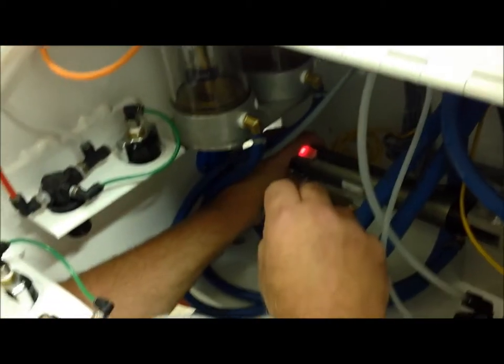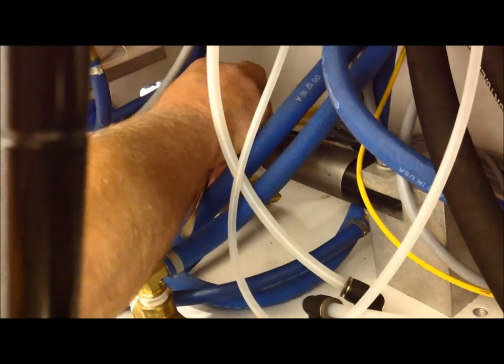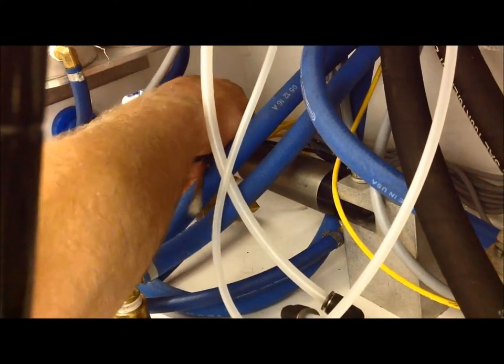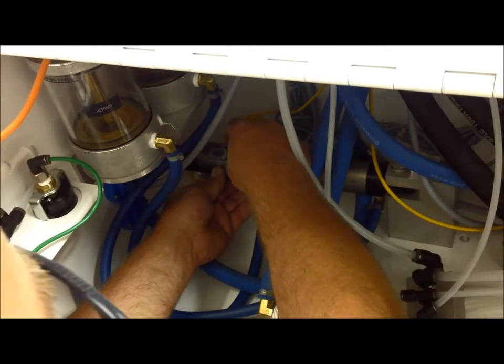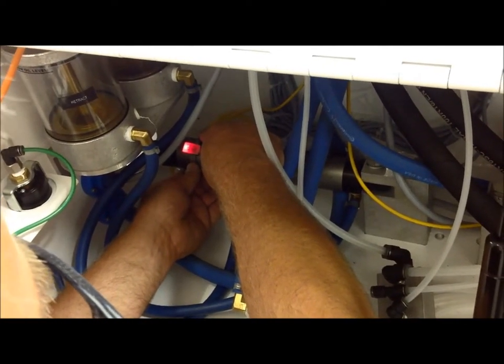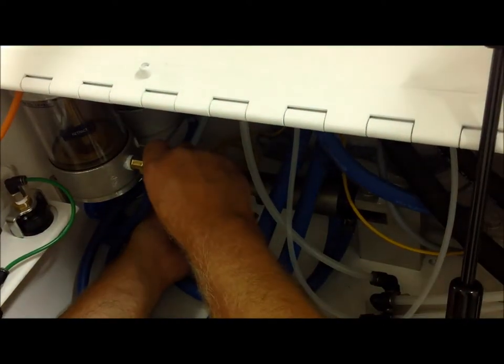little clamp up, and we're going to slide that ring up and down that cylinder until it turns on and off. See right there, it turned off, so we would make a mark on the cylinder. We'll slide it until it turns on, then it'll turn off again. We'll make a mark on the cylinder with a pencil. And then what we want to do is put our reed switch right in between there, because that's where the plunger is in the middle of that cylinder.